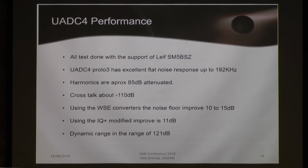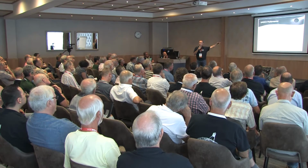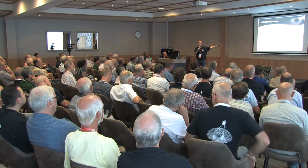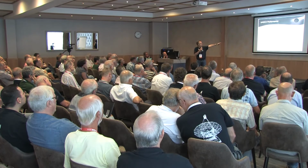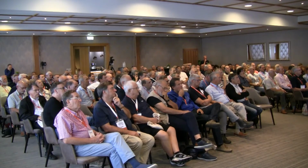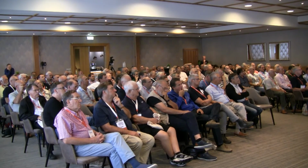The crosstalk between channels is in the range of minus 110 dB. Audiophiles proclaim and declare minus 120. 110 dBs is a trade-off. I can improve this one up to 140, but then my harmonic response is lower. That means I need to make a balance. 110 isolation between analog channels is more than enough for a software-defined radio application.